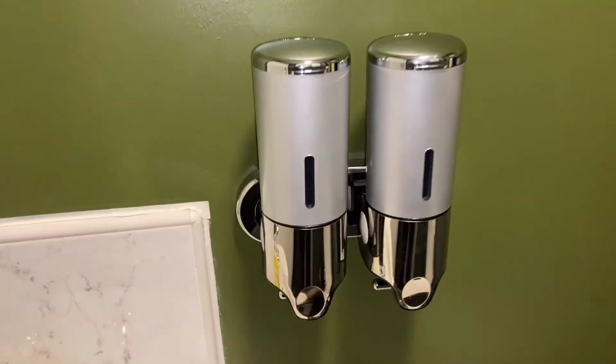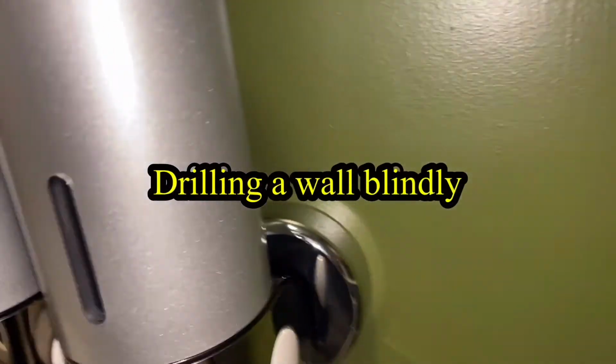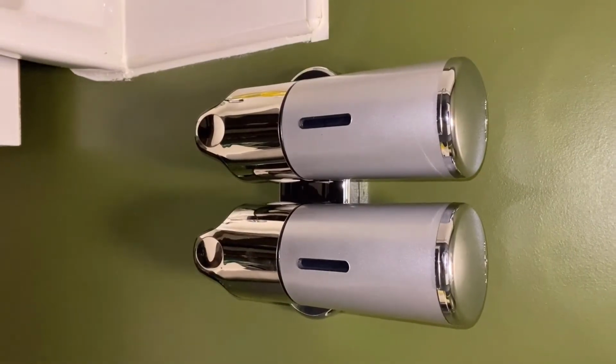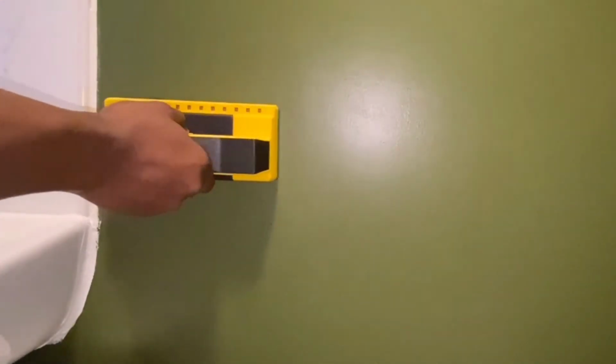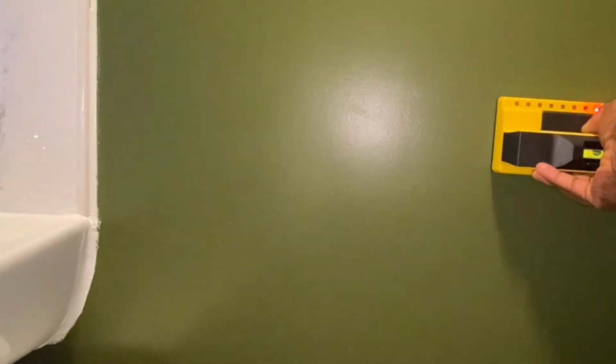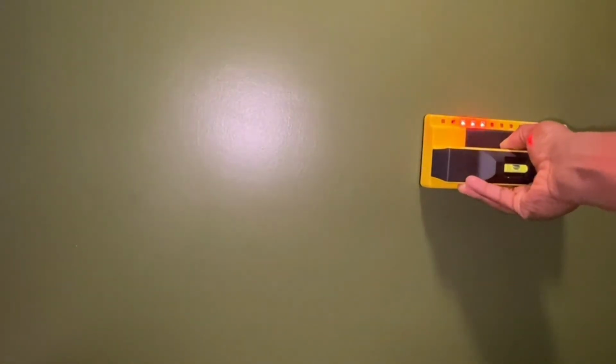And why is it important? Just imagine if a trim carpenter who installs a baseboard shoots a finished nail right into the center of a cold water pipe in your bathroom on the other side of the wall. Say in about 6 months' time, you might come to find your living room or your bathroom flooded. That's because the nail that you've driven through would, in about 6 months, start to rust away enough for the leak to start. Initially, you might not have any flooding because the nail that you had driven into the pipe was blocking the leak.